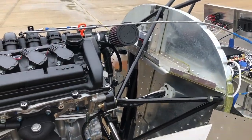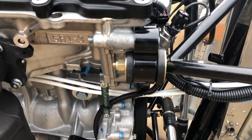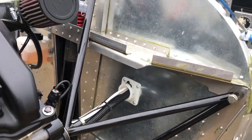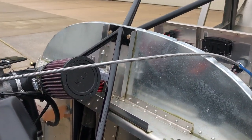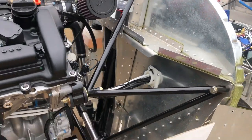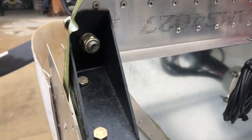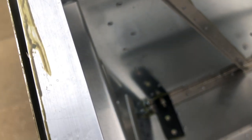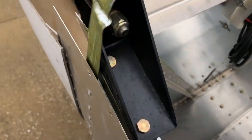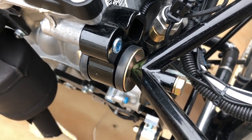Engine mount installation: basically some rubber grommets, engine mounts, and a TIG welded engine mount. Leave this one off until the end — that gets installed last, which makes everything else line up perfectly. It's a very quick installation using two-and-a-half-inch AN bolts through the firewall. Tighten that up, do the same at the engine, use the supplied bolts and tighten it up.